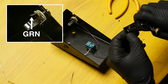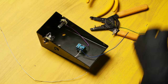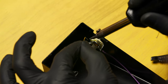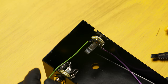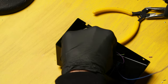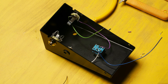Next, connect the green wire to the lug labeled green on the output jack. Strip and tin one end and solder it in place. Route the wire down and under the jack. You can strip and tin the other end of this wire right now — leave that aside, it'll be connected to the circuit board in a later step.